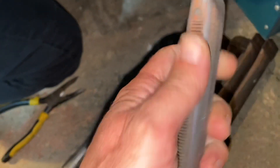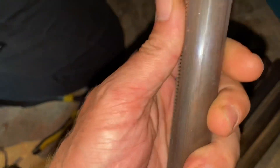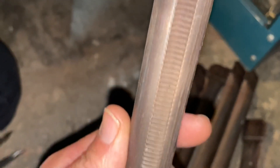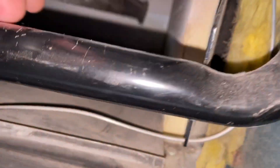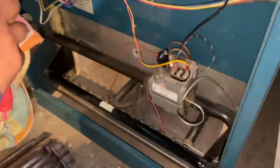Make sure that they're all clean — no rust, no corrosion. Any indication of rust on here is indicative of maybe the cast iron block condensing, getting condensation, or possibly even worse a crack or a leak in the heat exchanger. These all look pretty good. He's also vacuuming out the bottom of the combustion chamber, then we'll set these back into place — a little tricky because of this lip right there. You gotta get that in there. Set it down just like that — wash, rinse, and repeat. Get all the burners back in.